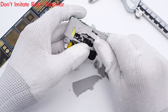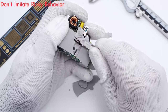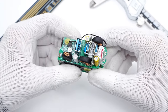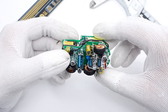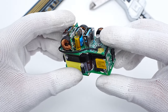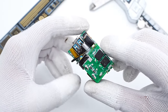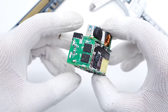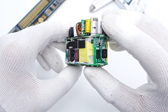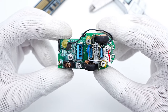Now let's introduce the USB module. It's composed of multiple small PCBs, making the size even smaller. The primary and secondary PCBs from the top and bottom are independent, insulated by a plastic bracket in the middle. There are two small PCBs on top of the module for output. Teardown analysis found it adopts a QR flyback topology, and the secondary synchronous rectifier also adopts GaN technology to achieve a full GaN design. There are two independent synchronous buck circuits for output, so you can use either USB-C port to get the maximum 65W.